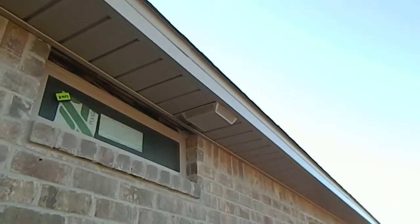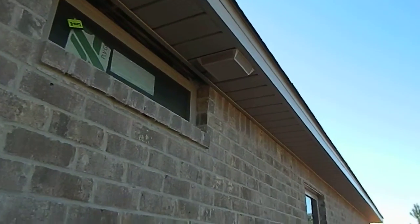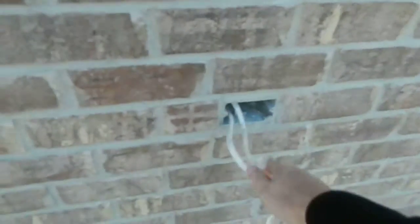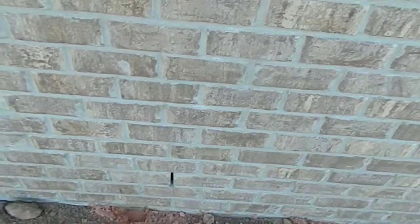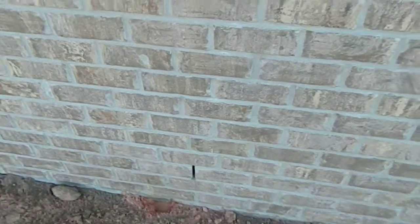As we walk around, these are your backflow preventers for your exterior vents for your bathroom. It's to make sure that nothing goes back into the house, only that air comes out through it. You'll have that at every one of the bathrooms. They still have to come back and finish up there. You've got an electrical panel connection, an exterior electrical plug, and these are the weep holes we went over before. Make sure you don't block them up. If you do not have a pest control service, make sure you spray in there about once a month with RAID or some other bug spray to make sure that you don't get ants up inside your walls during the winter. That can happen in the south.